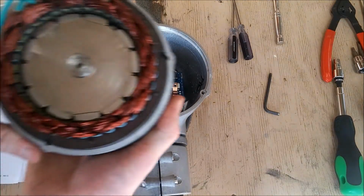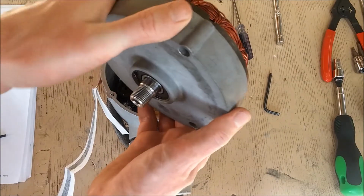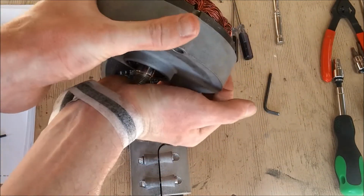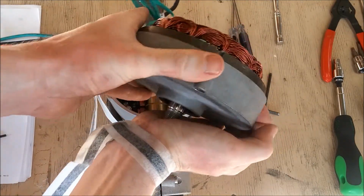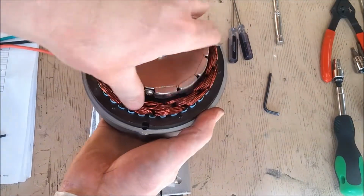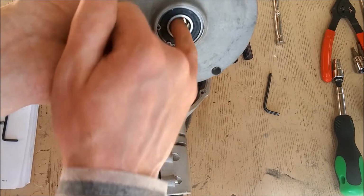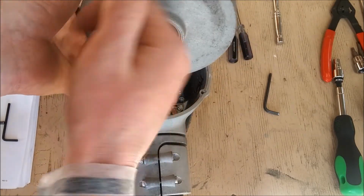Here I'm going to demonstrate how to remove the rotor for cleaning. This requires a moderate amount of force. So grasp the face casting with both hands, use the palm of one hand to push the rotor shaft straight in, and then use your thumb to push it all the way through and pull the rotor out. Now try spinning the face bearings with your finger and make sure that you don't feel any significant play and that they feel smooth.